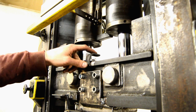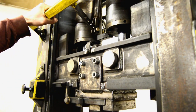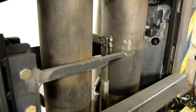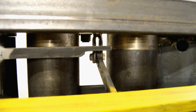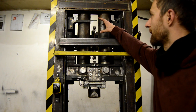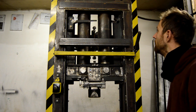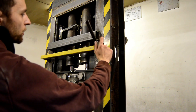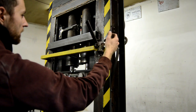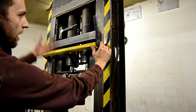I have a stop that prevents the ram from going up too far, and the same thing that stops it when going down. I really want to make these two stops adjustable so I can set different heights for the ram travel — that would be a really handy feature. I also want to put a switch here with a spring-loaded mechanism so it will automatically return the press upward every time.